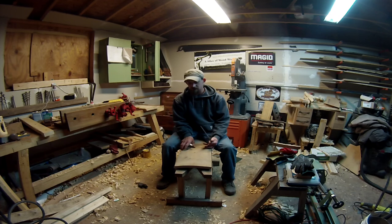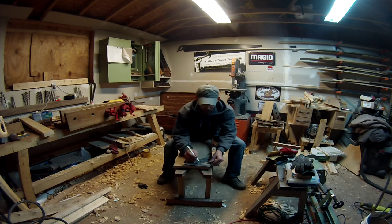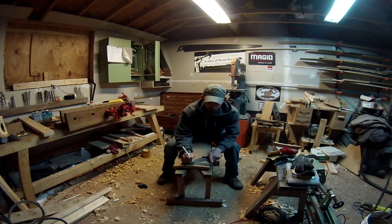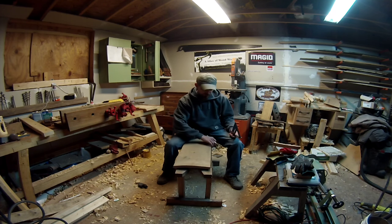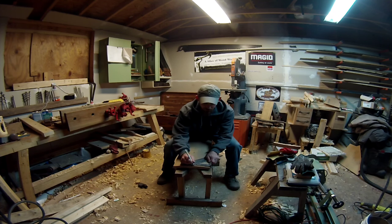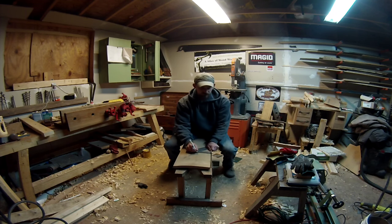The first thing is I've got to get two sections ripped down to three and a half inches. I'm just going to use my speed square and go to the four-inch mark, because I haven't planed any of the sides at all and I don't know if they're straight. So we're going to get them at least somewhat close to the correct length and then come back.